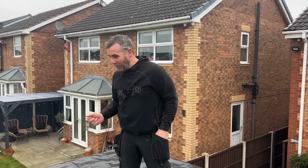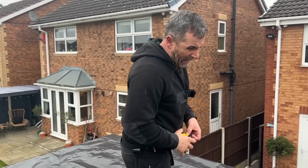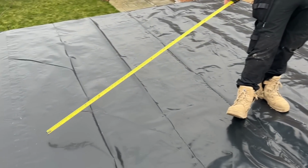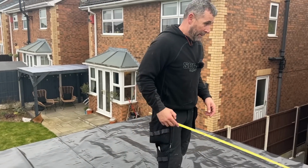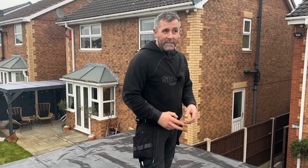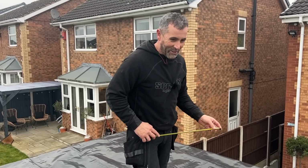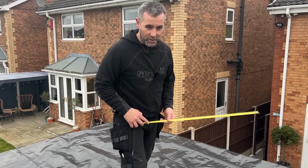Right, Monday we're back on it, so we're going to do the roof today. It hasn't rained all over the weekend, but if you're going to do a roof and you're going to have to protect it at some point, we normally put visqueen over it, 2 layers. Now, this sheet of visqueen was supposed to be 4 metres by 25 metres. This roof is 3 metres 850, is it, Jen? Yeah, all right. The visqueen wasn't big enough to cover it, so the visqueen was actually 6 inches shorter than what it was advertised.